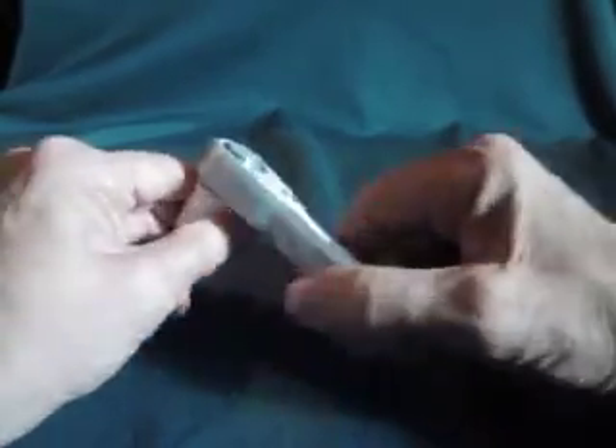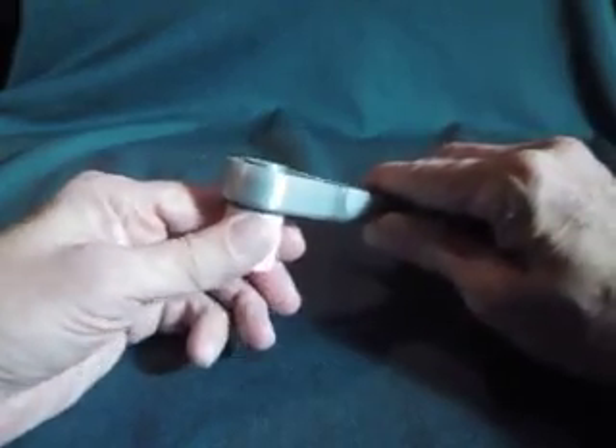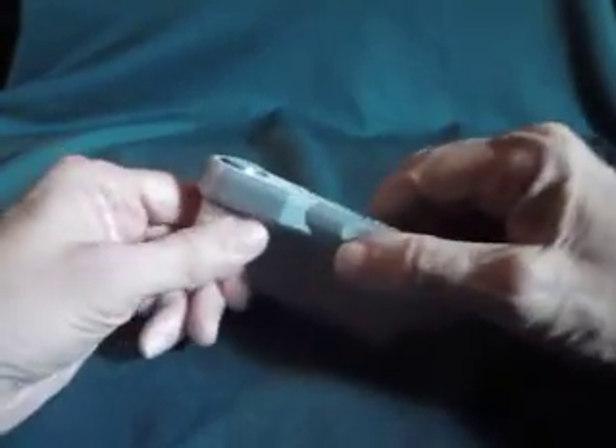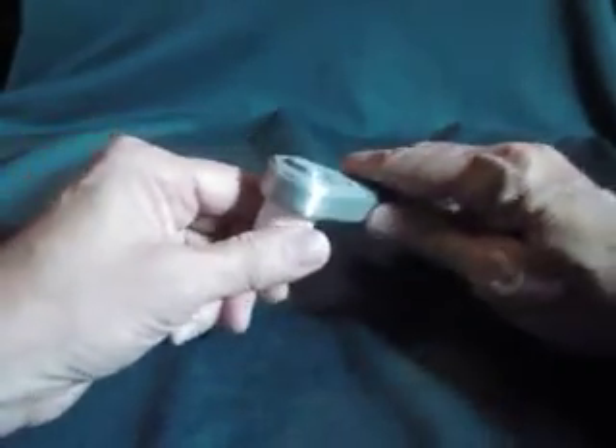So it is possible to have one wrench. Instead of printing two as a mirrored image of each other, I wanted to create a way to do both with a single wrench. You take this off, pop this out, take it out, flip it around to the other side, put the socket back in, and now you're tightening, and it ratchets going the other way.